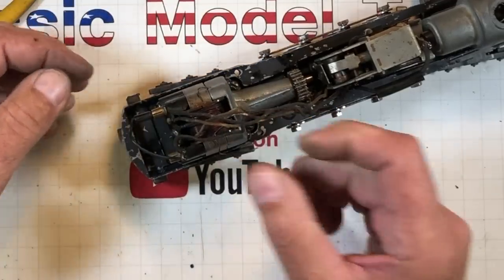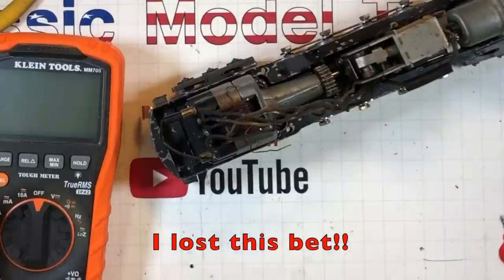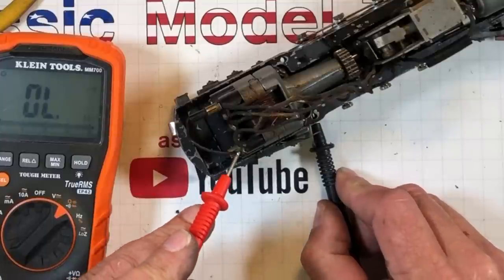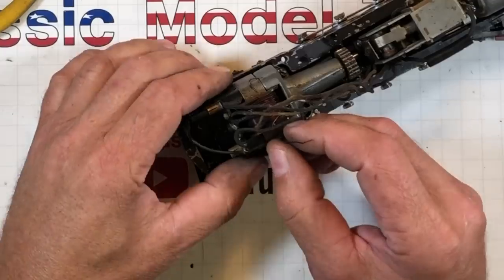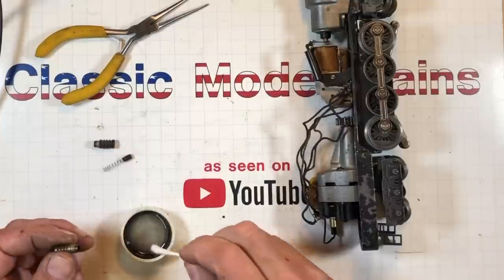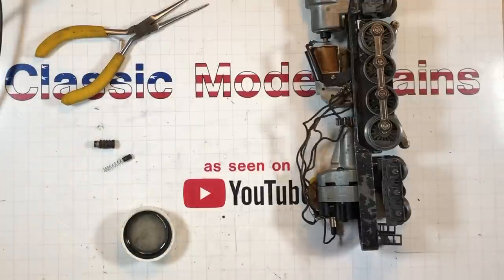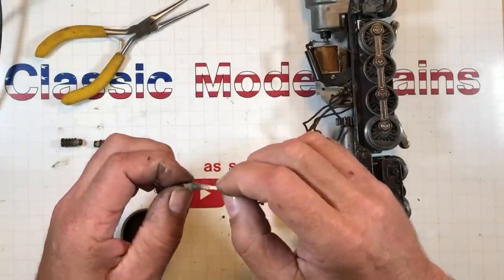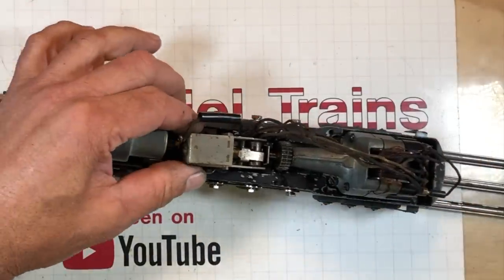Our electromagnet wire is broken off, and I'm willing to bet it goes right there because that's probably a primary pickup — the other one's going to ground. Using horseshoe mode — if I get one of these rollers down there and this post — yep, and that was broken off. Is that why this thing didn't run? Very well could be. So we'll get him situated over here, do a little solder repair on it, get the brushes in, and clean up inside these brush holders. These tubes get dirty. At least the brush is big enough to find on the floor.